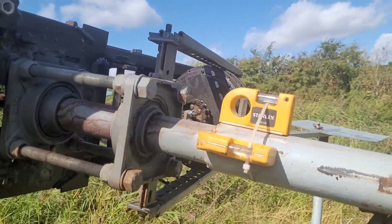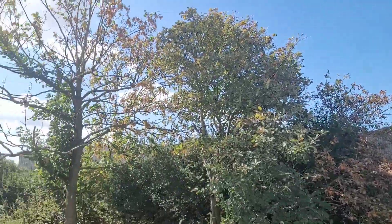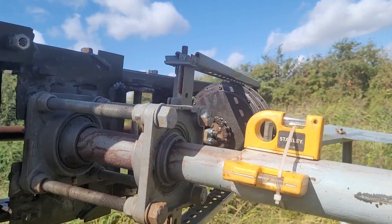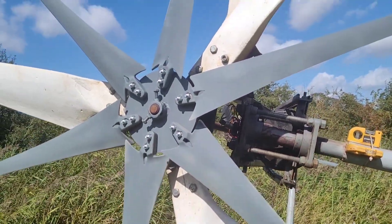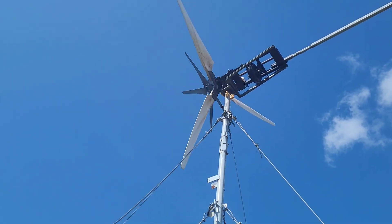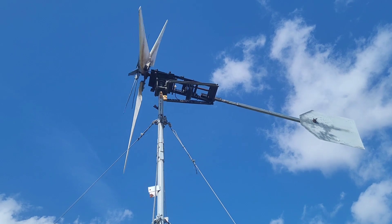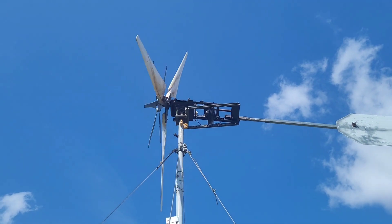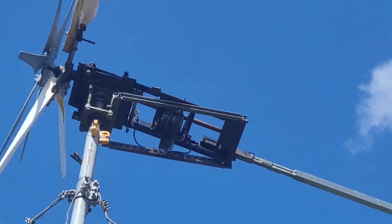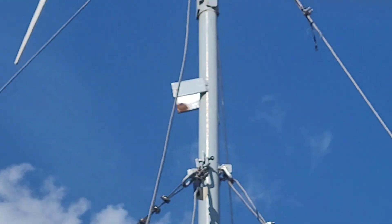There are a few things I need to sort out another time which I need help with because my shoulders are only running about 10% of capacity. So that's ready to go back up and I'm pretty sure there should be enough wind to get some movement — once it's moving that's it, it doesn't take much to actually be making power. I'll keep it set up at 24 volts but there's always the option to change the battery and flip the dip switches on the controller. You can see it's not the ideal angle but I believe it's connected directly to the dump load. Clearly you can see the one kilowatt bike hub is turning. All I've got to do now is get these tightened up and the slack taken in — ready to rock and roll.